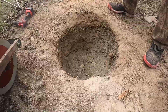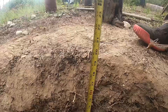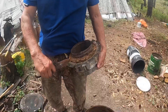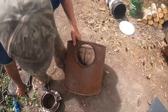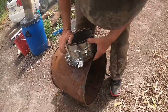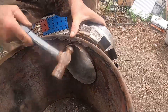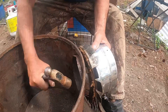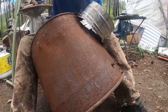This is the key to the whole thing — it's our underground stove. We dig a hole, and this is fitting a piece of chimney to a small barrel that's going to be the main guts of the stove. I've found from experience that the first thing that burns out is the exit where the heat enters the stovepipe, so I'm using a double-layer insulated fitting on there to hopefully lengthen the life of it.